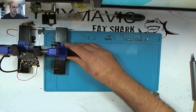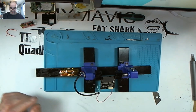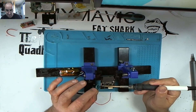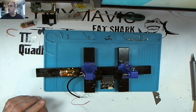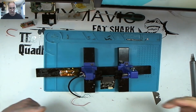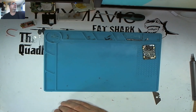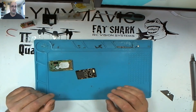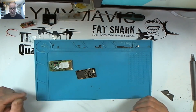With that done, it's time to unplug and take off the wires that are attached. Be very gentle when taking them off — you don't want to pull a pad off, so just heat them up until they literally fall off. If you've used flux, use a bit of IPA to clean the board off. Now plug everything together and give it a test — it's just a reverse operation of the opening procedure, put everything back and screw it together.